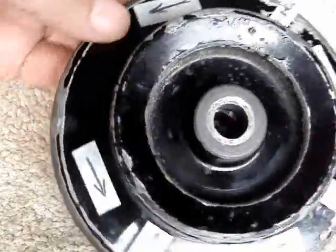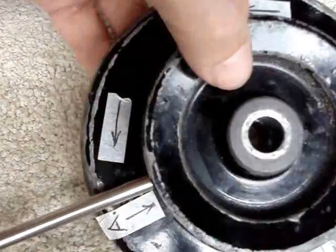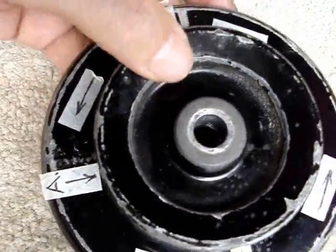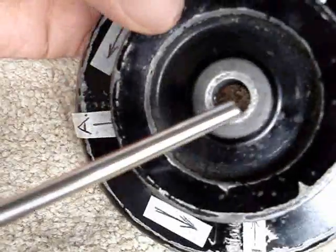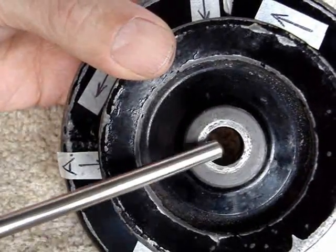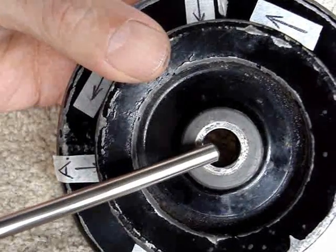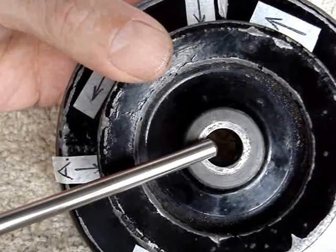I just don't want to deal with only having a little tiny bit of threads left in the whole business anymore. I was going to make another hub, which would entail having the correct taper — so I've got to figure out what the taper is before I can bore it out on my buddy's lathe.